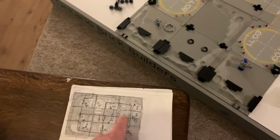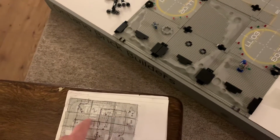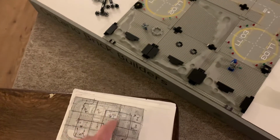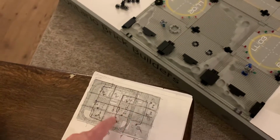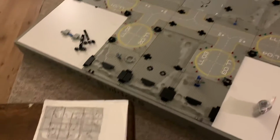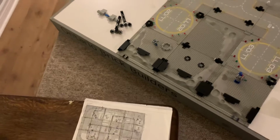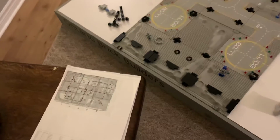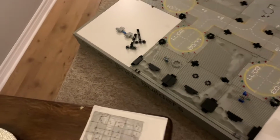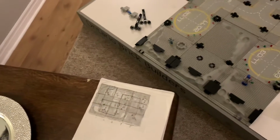Because if I just run it straight across and have little branches going off, like a tree, you have the trunk, the main ribbon cable going right across, and then I just run the wires back to there, and then back to here. That's gonna save me a lot of ribbon cable. It's also gonna save me a lot of drilling, because I want the ribbon cable to go through the joists instead of under the joists. I don't want to put hangers to hold the ribbon, because when I store this, I pile the 2x4s up in the attic and the joists in the garage. So I don't want anything that's going to catch on anything.